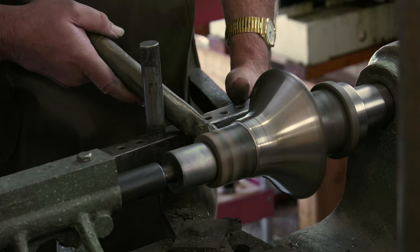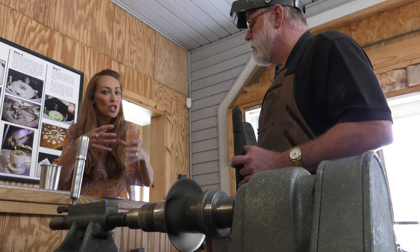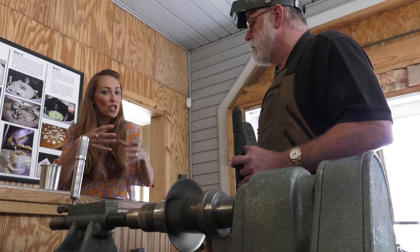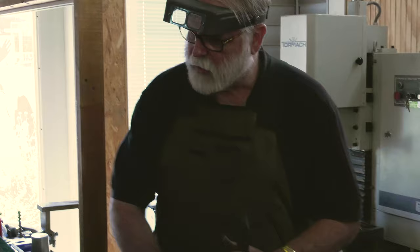What I find fascinating with what you're doing is that you are shaping that cup perfectly without any folds. We're looking at a circle here, and you would think if it was going to go into a cup that it would need to fold to make that shape. But we're reintegrating that surface area into itself — that way we're maintaining the thickness of the sidewalls of the cup. Otherwise, if we didn't do it properly, we would lose that thickness.